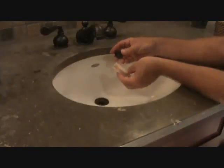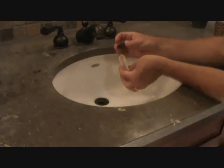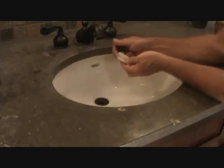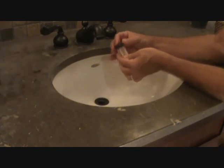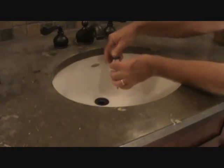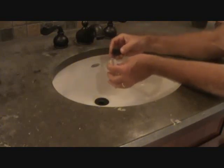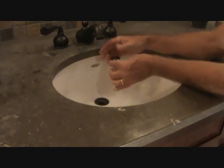Now's the time to show you a little trick. If you have a pop-up valve where the top is not screwed on tight and your water leaks out or it's just loose and you don't know how to tighten it — well, you've got plastic threads here and you can't tighten this up the way you would normally. These are reverse threads, so you have to screw it on like you're doing it backwards and you'll tighten it up. If you don't know that, there's nothing you're ever going to do to tighten it. It's not going to be because the threads are stripped — just tighten it up backwards.